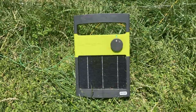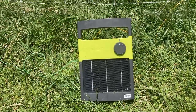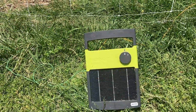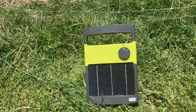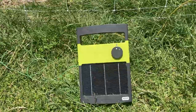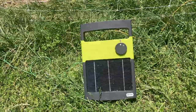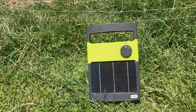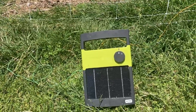This is the Patriot charger — we have the most of these, I believe three now. It's the SG 150, a half-joule. A half-joule will run two nets; the 0.25-joule will only run one net and is a little cheaper. These little guys have been a perfect mix for us. If you're starting out, I would highly recommend something in the half-joule range because it'll run two nets, and on occasion we've hooked up three and it'll run them, just a little weaker.